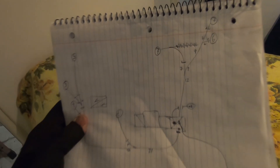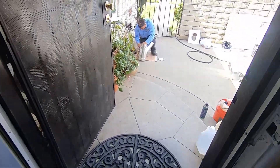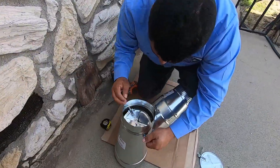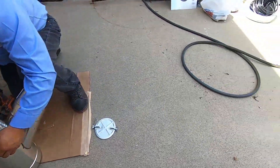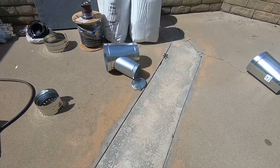Okay, next day — we already have our plan, we already mapped out what we're gonna do, what size ducts we're gonna use, where the returns are. I'm gonna put two 14-inch returns. Now we're putting our dampers on every supply, each one has its damper. Kind of staging everything right here — we're ready to rock and roll.